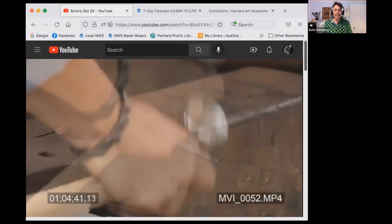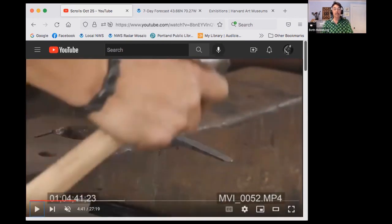It's a great idea to test this cold before you heat your metal up, so that you can make sure you're in the right place on the anvil. I usually forge with my hammer side hip against the tail of the anvil. That's what works for me. But practicing so you know you're in a good spot and it's all going to work out well is a really great thing.